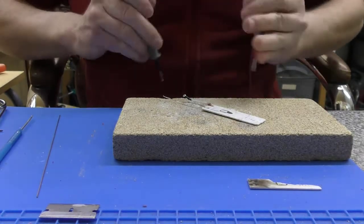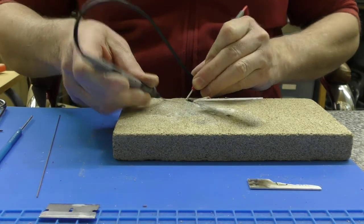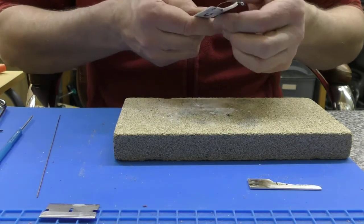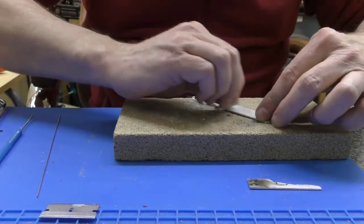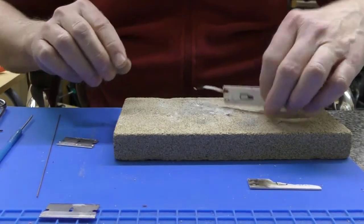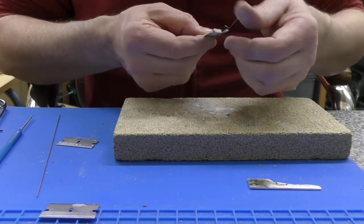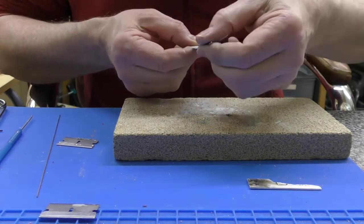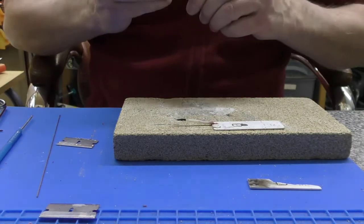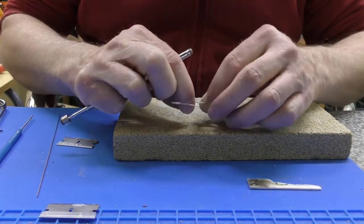So if we just check the readings here now, I'm hoping, yeah, 74 ohms, so that is a repaired element. Hopefully there'll be no issues when we pop that back in. It could be that the flame is so fine that it's not really stressing out anything too much. So if we wanted to go with the nickel wire as per the original, that would be the way to go. And nickel wire is slightly magnetic, as you can see, and the original one is...